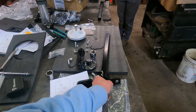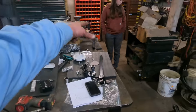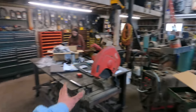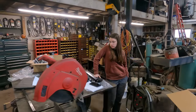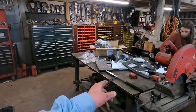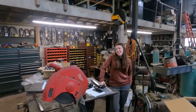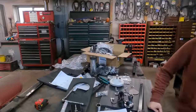We've got the five-eighths or 16 millimeter bolts coming out of the top of the cab. They bolt into this L-bracket that holds the cross tube on each side, and then we can fasten the receivers down. There are a couple of antennas that stick to another bracket. I've got to get some welding done here — we'll get that up on top of the tractor cab, show you what that looks like, and then we can start the wiring process.